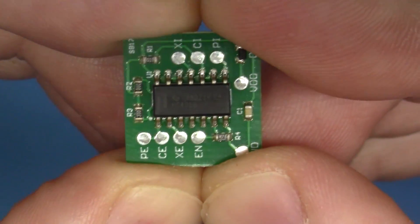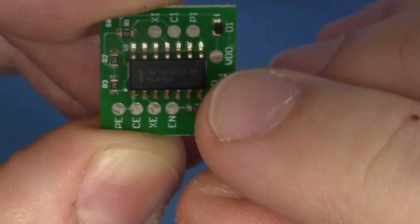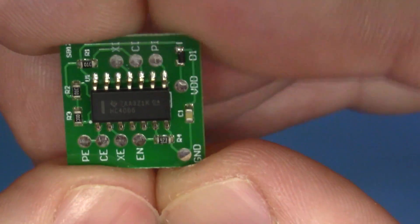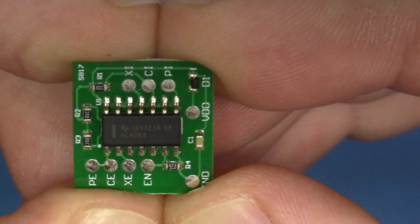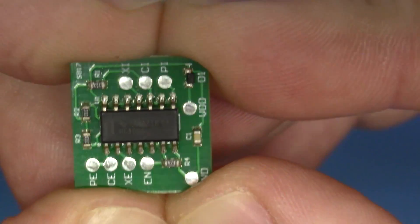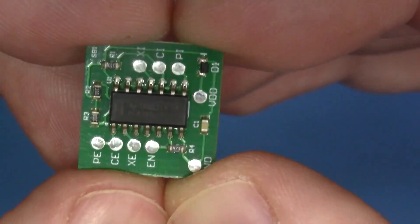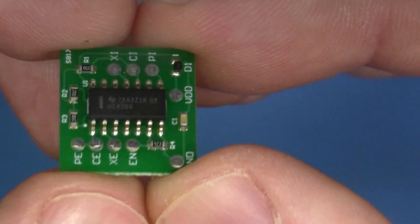Let me take it out of the packaging here. So we're looking at this switchboard — what is this responsible for? The part number is an HC4066 on board, so this is a bilateral bus switch. Basically, the way this thing operates is that the CD-ROM drive and the PSIO — you need to switch a couple of those signals and gate them from one device to the other. If you're wanting to use the PSIO, there are a couple of signals that need to be routed only to the PSIO and blocked from interfacing with the CD-ROM drive. Vice versa: if you want to use the CD-ROM drive, those same two signals need to be switched to route to the CD-ROM drive and not to the PSIO. You're taking one device off of the bus and putting the other device on, so they won't conflict over the bus.